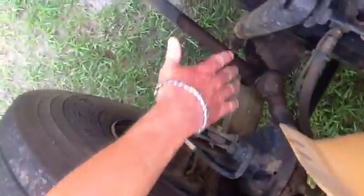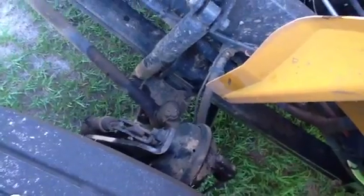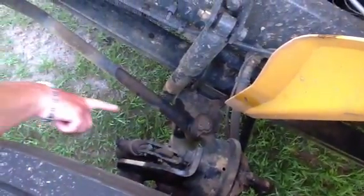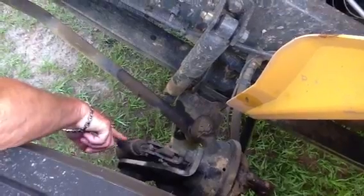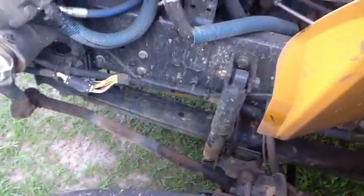The swing arm is not busted, broke, cracked, or frayed in any way. The brake chamber is not busted or broken, cracked or leaking in any way — should work fine, not missing any bolts. The push rod and slack adjuster — this thing here in the middle is actually the push rod. They're not busted, broken, cracked, or frayed. They're not messed up.